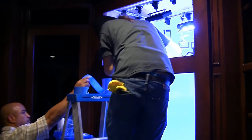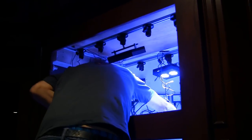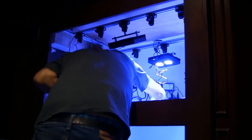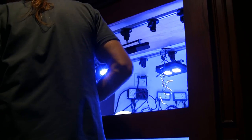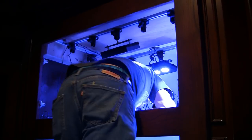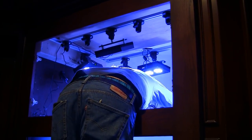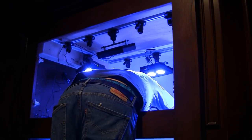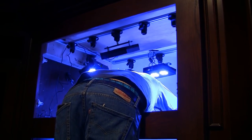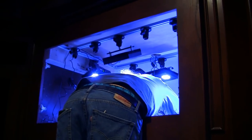So we managed to get the siphon noise resolved by opening up the hole in the top of the Durso, but also created a noise issue in the Durso. They're now trying to restrict it. The hole originally was 1/4 inch. I drilled it out to 1/2 inch. There you can hear, so it is still creating a bit of a siphon. And of course, he's restricting the size of the hole right now. That's the noise coming along with it.